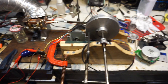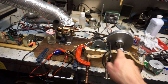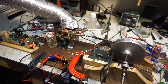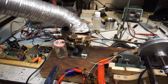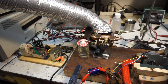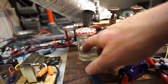Sometimes it runs really well, sometimes it doesn't. Max RPM I've gotten up to is about 4,000 RPM, which is insane. At some points in the video it was going about 3,000 RPM, but most of the time it's generally between 2,000 and 3,000. I can get it to idle down to about 800 to 900 RPM — not too bad. Fuel consumption is about 1 to 1.3 grams per minute, and it drains the tank in about 15 to 20 minutes.